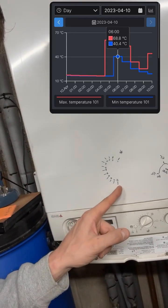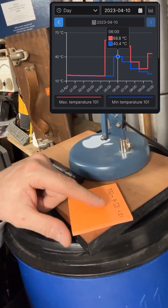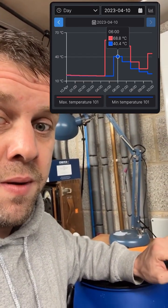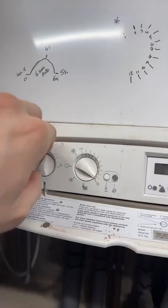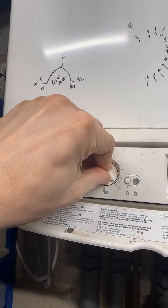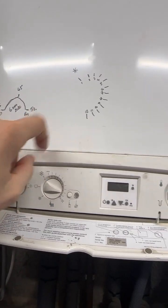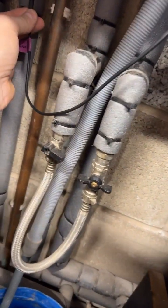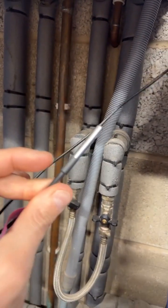I've written a little chart on here with the frost stat and 12 positions, and I've started logging on this pad what my flows and returns are. The good thing about the Shelly is I can look at the historical values on my phone rather than sitting here reading a thermometer. Today I'm going to turn it down by two notches, so it should go out cooler and come back colder.